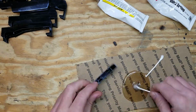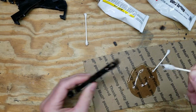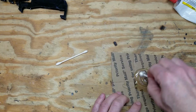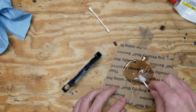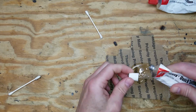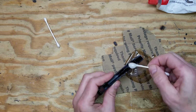The black keys were a little bit tougher because it's much narrower. So I spread the epoxy inside the key as best I could, put the weights inside, and set them aside just like I did with the white keys. You have to be very careful not to get the epoxy on the outside of the keys because it's very tough to get off once it is there. You see a couple times where I actually got some on my hands and accidentally put it on the key, so I had to wipe it off.